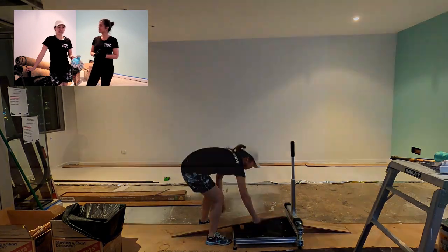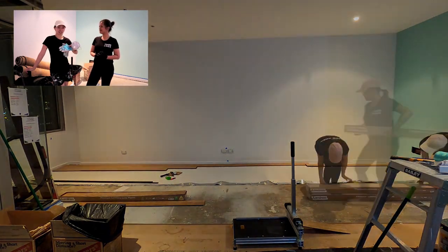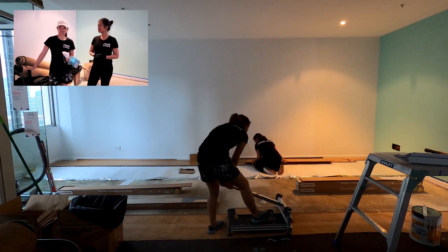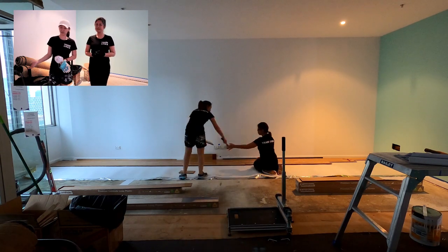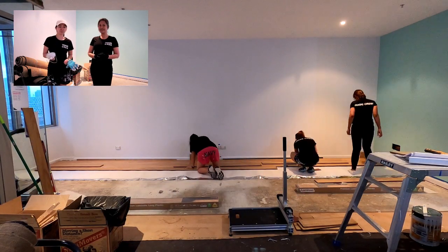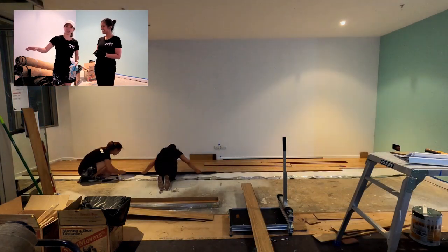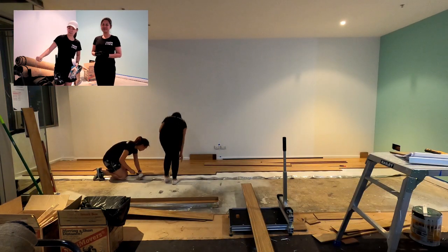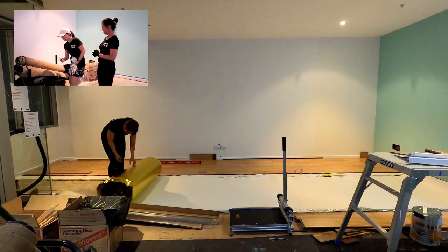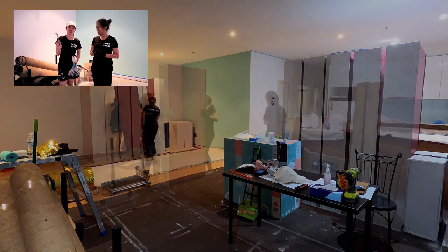Before you start, have all your tools available and in really easy access. Always wear gloves and also a P2 mask. Whilst ripping it up, things can be in the carpet and there are also nails — it's really dusty so just always mask up to protect yourself. The process is you start from the corner, rip off the carpet, and grab a carpet knife, which is one of these special little tools. If you don't have one, you can just use a nice sharp Stanley knife.